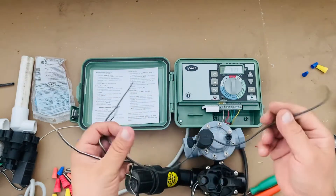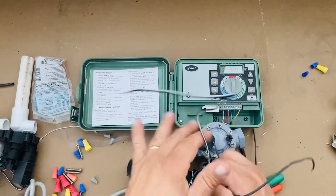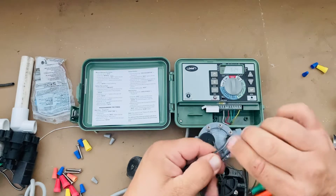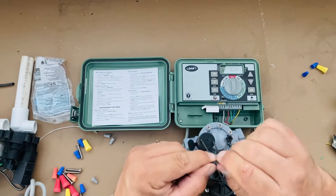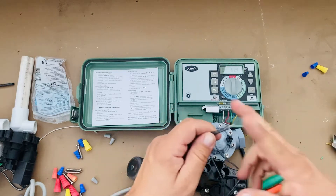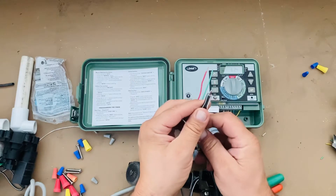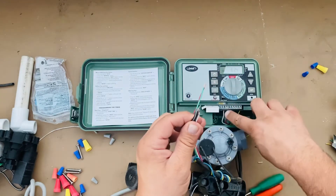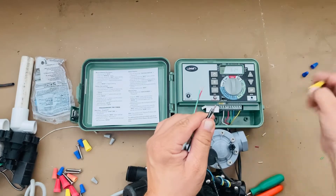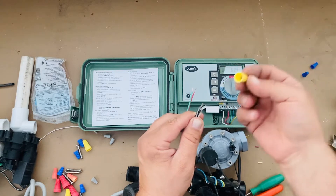What you want to do is grab one wire from each solenoid — the color does not matter. Twist them both together; if it's too long you can cut it shorter. This end will be your common wire. The common wire in the field is going to run power to everything. I am using non-grease caps here because I'm on my workbench and I don't want to be covered in grease.